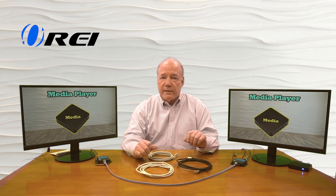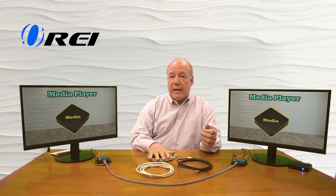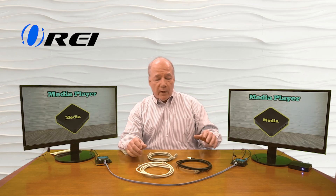All these cables look very similar. Here I have three cables: this is a CAT 5e, this one is a CAT 6, and this is a CAT 7. Depending on the distance and the type of content you're transmitting, you'll want to select accordingly. If the cable's already run, you don't have a lot of choice, but if you're running a new cable, my suggestion would be at a minimum to use a CAT 6 or even a CAT 7 if you can afford it. It's a little more expensive, but worth it — if you upgrade to higher resolution or extend that secondary location further away, having a CAT 7 cable will accommodate both situations.